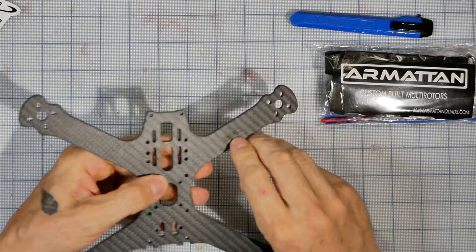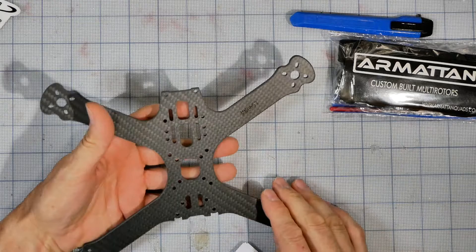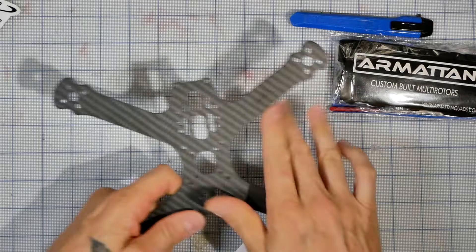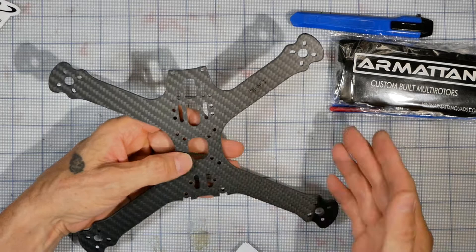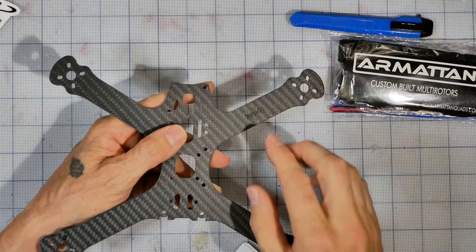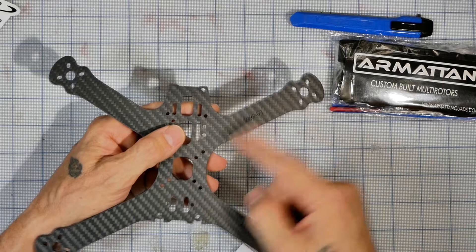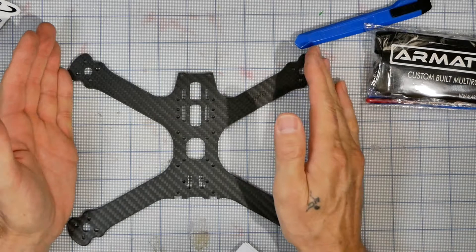Looking at this right off the get-go — they've even laser engraved a part mark. The thing I noticed is that with the Chameleon we used to break it out of the bag, take it into the shop, and put a little radius on the edge so you don't catch on it. Besides feeling nice, putting a radius on your composite parts means that if there's any impact, it increases the likelihood that the object will glance off rather than catching and delaminating. This subtle extra work — putting a chamfer or fillet on the edge — is a good touch.